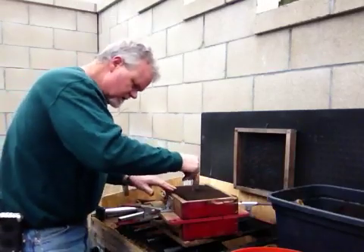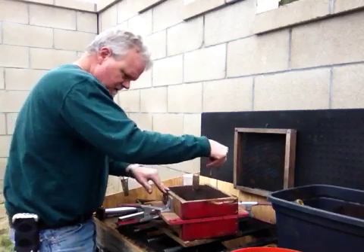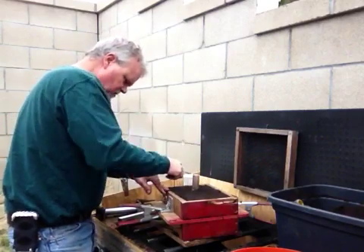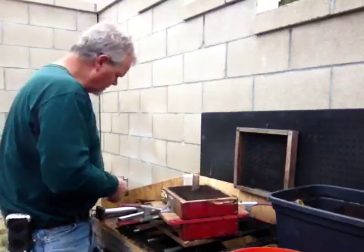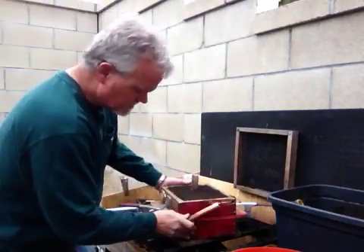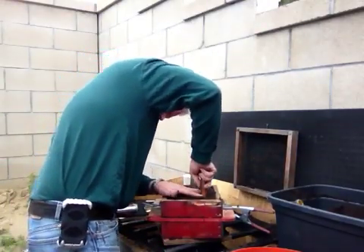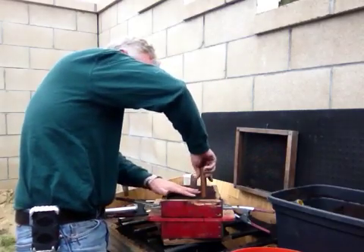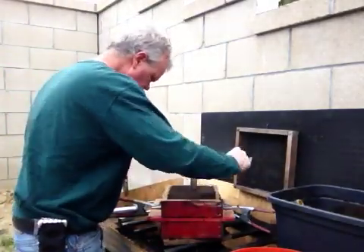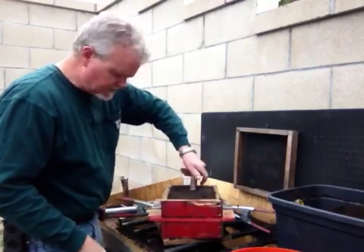This is a vent rod. I poke that in the sand so that whatever gas is given off by the hot metal as it cooks in the sand, it can vent through the sand. And then the other is this — this is the feeder, so it can have the metal pour through. That hole that I just cut was the gate for feeding the metal in.